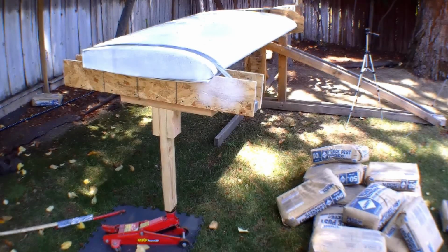This means that locally the wing is loaded up quite heavily, way more so than it'd ever be in real use. So the shear in the wing and the load on the wing skins is much higher locally. I used a piece of 3/4 inch thick styrofoam between the bags and the wing itself to help spread out the load from the concrete bags. And we tried to load the concrete bags as closely as we could directly over the spar.